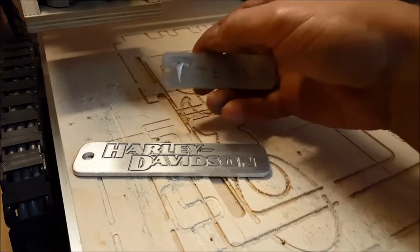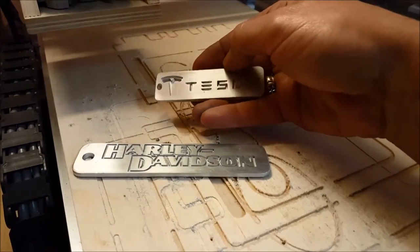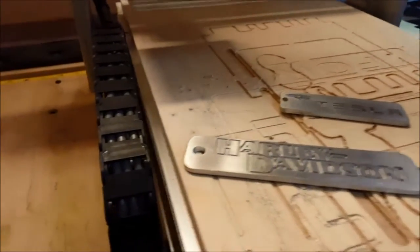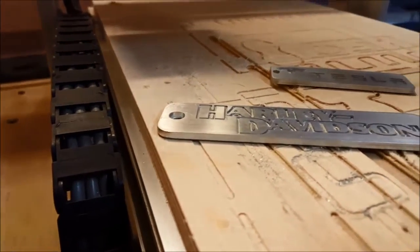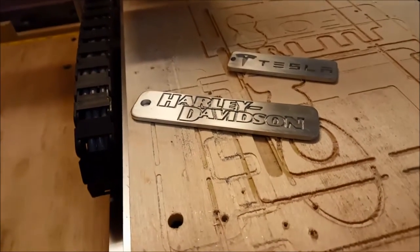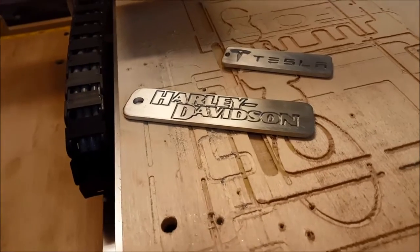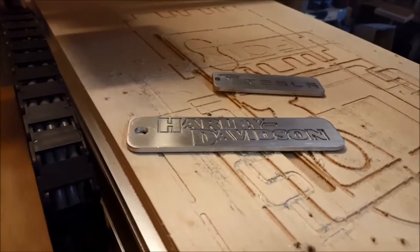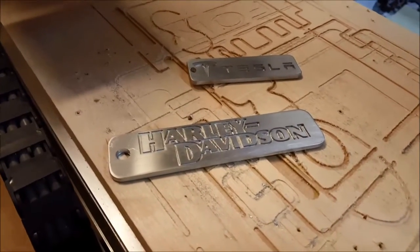This was the one from the other day. So again, the trick with this is to go really slow with the feed rate, do shallow cuts, set up the machine, let it do its thing, and just disappear for an hour or two while it's cutting everything out. Pretty cool — thanks very much for taking a look.